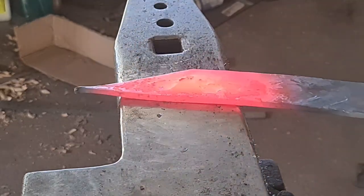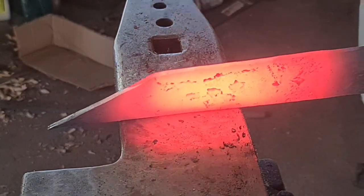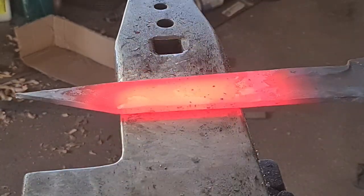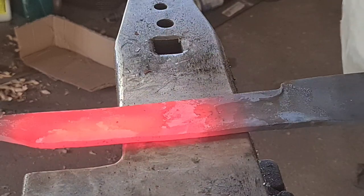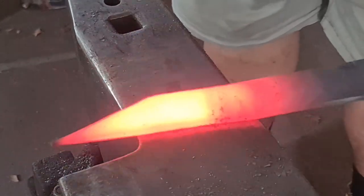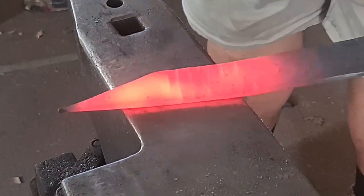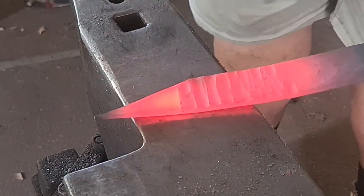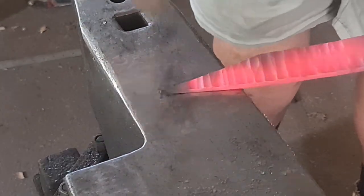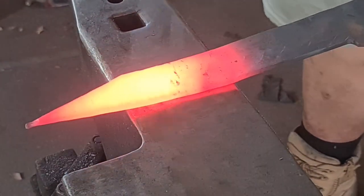I like a nice sharp transition between the spine of the knife and the angle of the point. Now it pays to remember that when you're forging your stock, you want to distally taper your stock, but you also want to do a lateral taper — from where the ricasso is going to be, or where the heel of the knife is going to be, down towards the point in both angles. As you then draw your distal taper, that end is going to widen out a little bit, meaning you'll end up with either parallel or wider at the tip. Unless you're specifically aiming for wider at the tip, like with a sax, you want a little bit more of a taper.